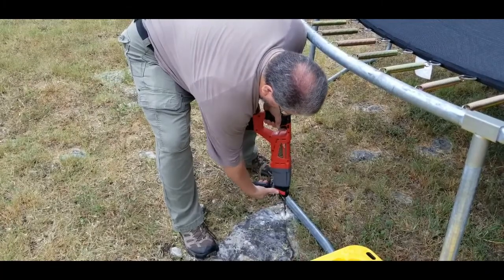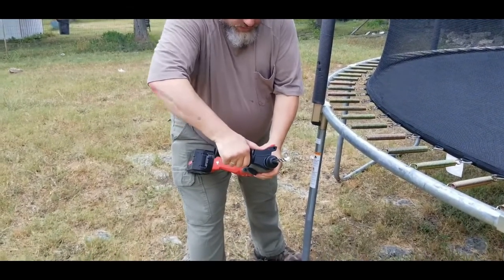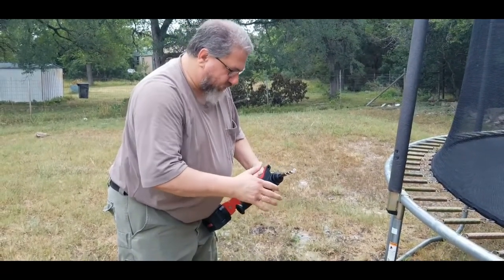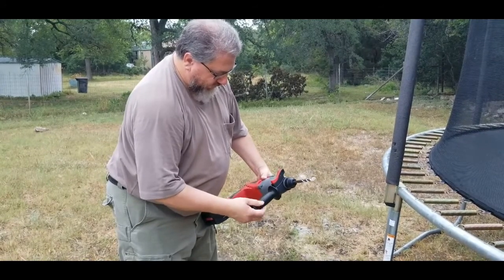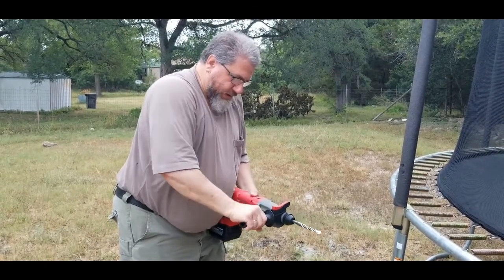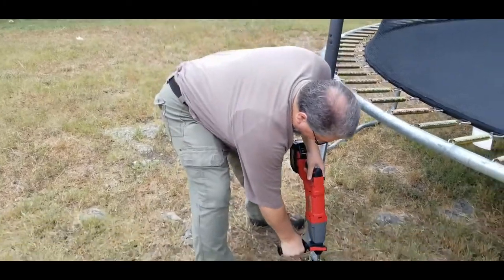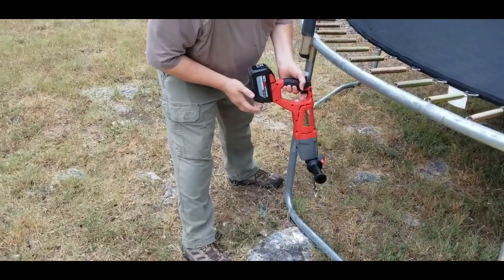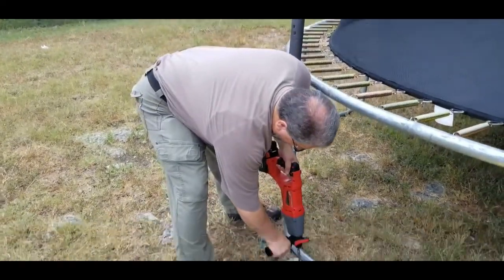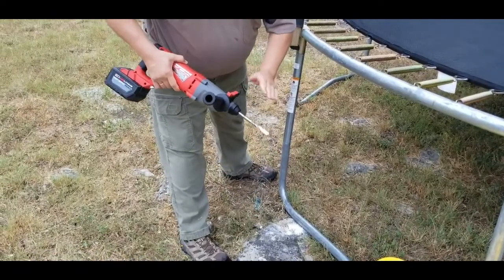You need to have a good tight grip on the thing. This has an ingenious depth gauge which we probably should use, but it's not so important for our test - we need to rotate this for the job we're doing now. I'm using our 12 amp-hour battery, probably an 8 or 9 would be good enough but this is what we have. It's going well - now we'll get our anchor and see how that goes.